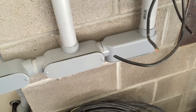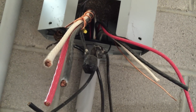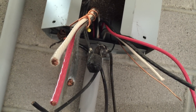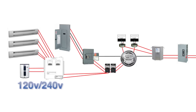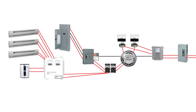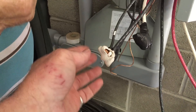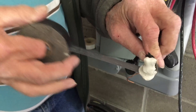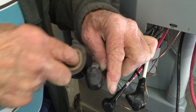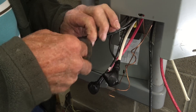This transformer is wall mounted on concrete block in hopes that any vibration will not transmit as sound into the living space. Quality transformers can be wired in a variety of configurations. We have chosen to tap the secondary side of the transformer to supply the same type of power we had from the original spring-fed powerhouse. To connect large gauge wires, we use copper split bolt connectors. We put two layers of cushion tape, which are then covered with electric tape, to prevent any abrasion over time which could result in short circuiting and the potential for fire. We are stepping down from 480 volts on the primary input side to 120/240 volts on the secondary output side.